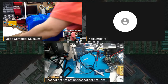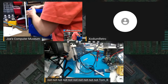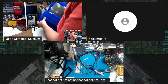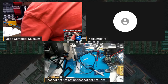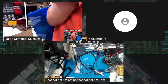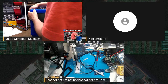So I picked up the Garrett's Workshop RAM SIMs before a bunch of other people started making the VRAM SIMs or RAM SIMs, and it was the same deal. The RAM slots in the board get loose over time from upgrades and stuff, and the PCBs are slightly thinner than what the original PCBs were.